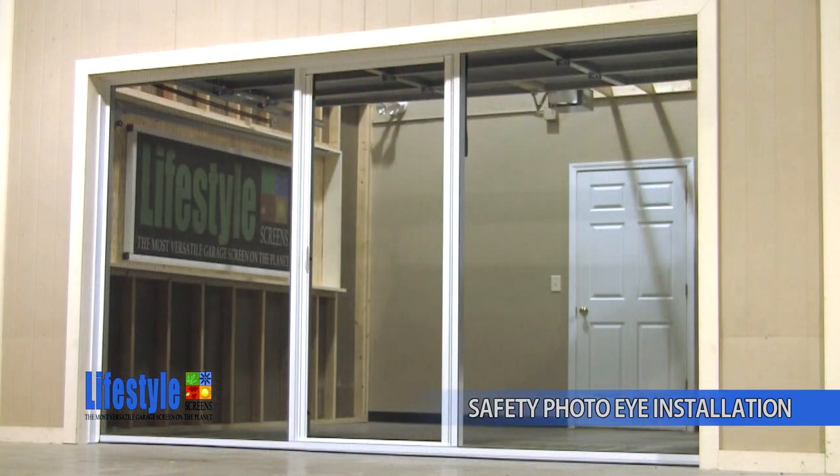Now you will need to test the door to see that the safety photo eyes are properly blocked to prevent the garage door from operating. If you press the wall or the remote button for the operator and the light flashes for several seconds and then comes on or continues to flash, this will indicate a proper blockage of the operator's safety photo eyes.